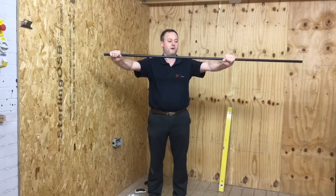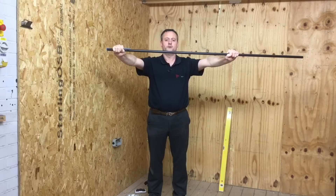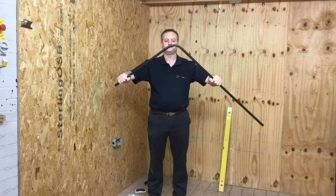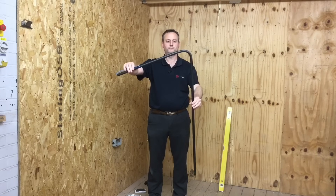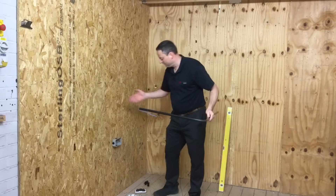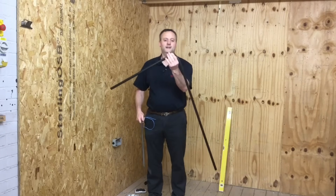For my technique, get onto what I call a large motorbike position — arms at about that width, adjustable depending on the student. From that position, fold it in, hold it, allow it to come out, fold it in and hold it. I want to leave it in a slightly overbend position — rested beyond 90 degrees, possibly about there. The spring needs to come out and the conduit needs to rest for a couple of minutes before we do anything else.